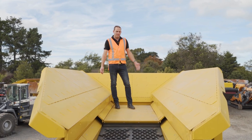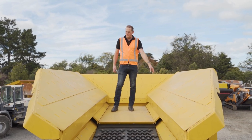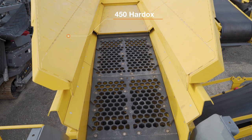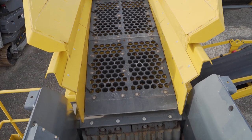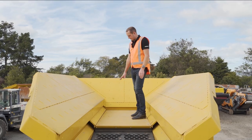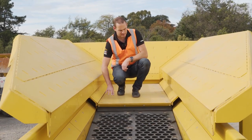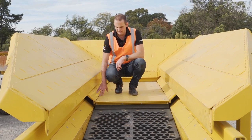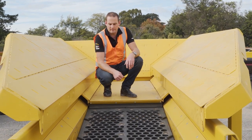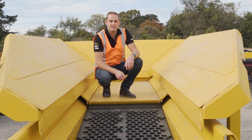We're now standing in the hopper of the B4. As you can see, this beast has been clad with Hardox 450 grade — something we bring in as standard. We want this machine to last the distance of its life without having to re-skin the hoppers. On the feeder, this is a linear feeder with Hardox lining as well, which is easy to replace. We then drop onto our double-deck prescreen, which is 2.3 metres by 1,100 — a very decent-sized prescreen.